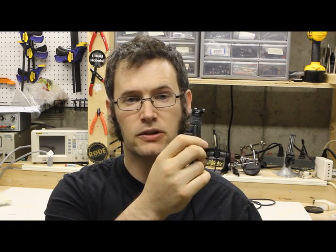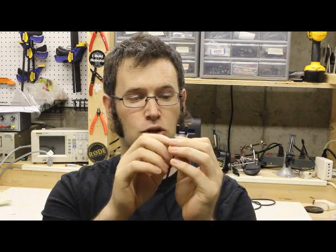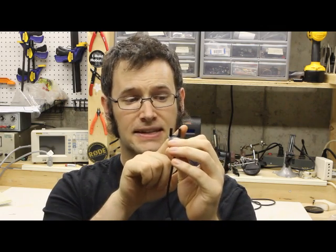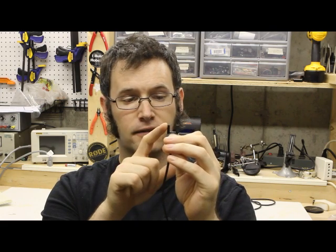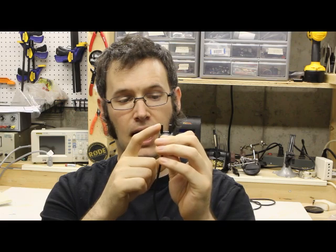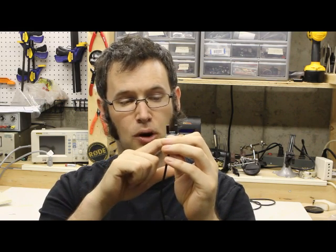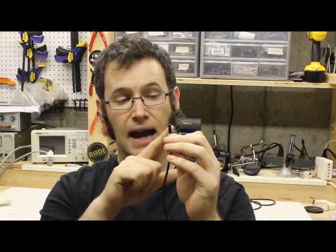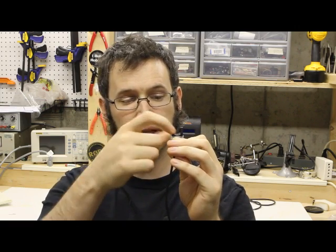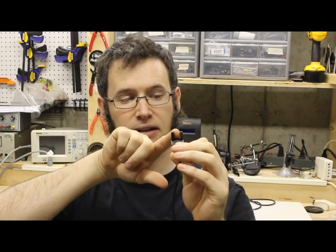This is another one of those sensors you can plug into the Camera Axe. The way this sensor works is it has an IR LED in one of these posts and a phototransistor in the other to detect the light coming from the IR LED. When nothing's between these two posts there's a high signal sent back to the Camera Axe, and when something's between these two posts then a low signal is sent back to the Camera Axe.